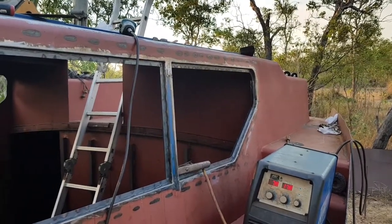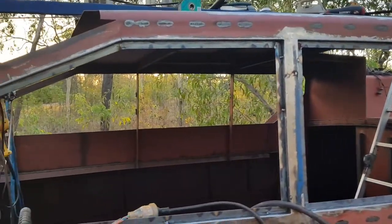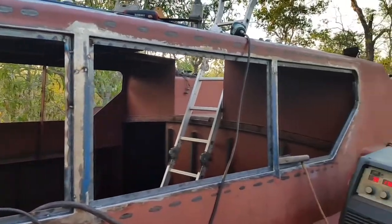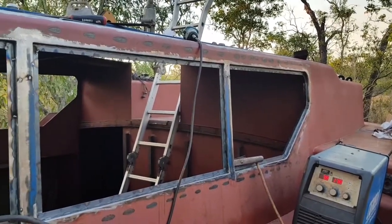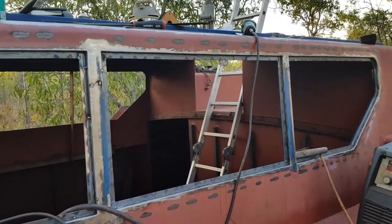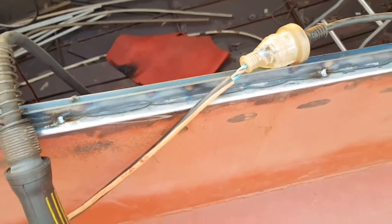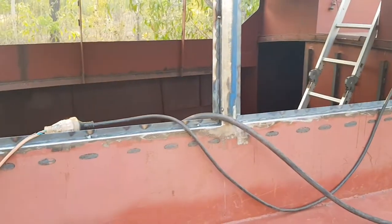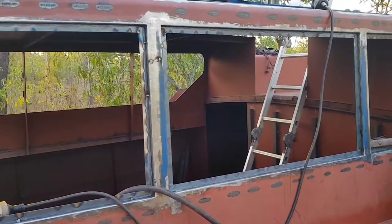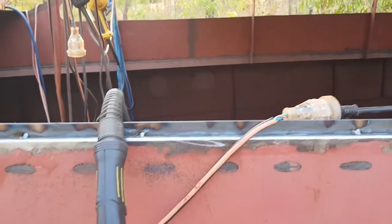It's been a big week or so cutting out these windows and getting the frames in. On the other side of the boat the cutouts are ready to install the frames; on this side I've finished so the frames are installed all the way around. It's a bit more complicated than it might seem because this wheelhouse has a slight curve along the deck line. Each section of the window frame — you can see the square tube over the top there — has to be bent to match the shape of the pilot house before it's welded in, and I have to do that for every frame, top and bottom.